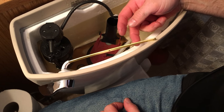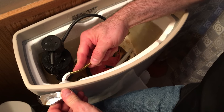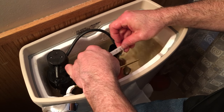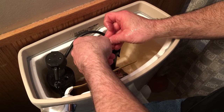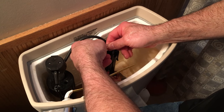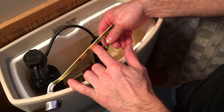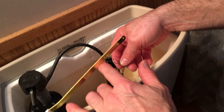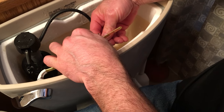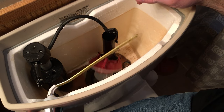You can see in our case our arm here is hitting on the tank, so I've got to give it a little tweak to get it over into the right area. Now I'm going to just reach in here and remove this old arm from the flapper chain. This arm comes with a few different holes depending on where you want to mount it. You can also cut this arm off if it happens to be too long for your toilet. So I'm just going to try a hole here and see if it ends up working.